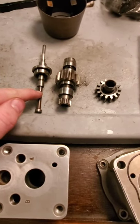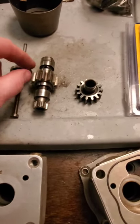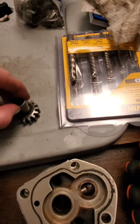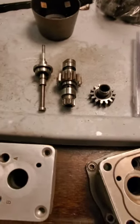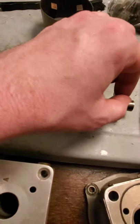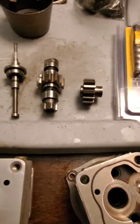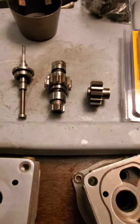We've got our pilot valve along with the spring collar. We've got our main pumping element and hollow gear shaft — it's hollow. We've also got our idler gear and its hollow support as well. We're going to talk about how the pilot valve moves inside this gear shaft to port oil to or from the propeller. But before I do that, I want to talk about how — in our last video — we discussed how when the propeller is in the on-speed condition, these pumps are still running and producing oil pressure.